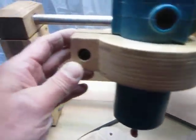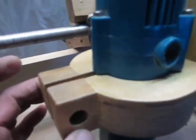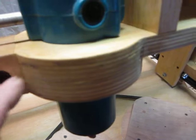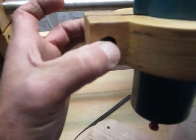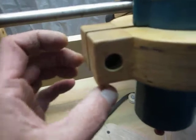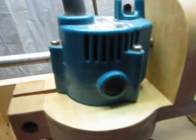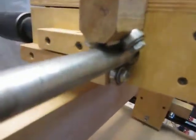For the upper part I used birch plywood. I glued two blocks — I didn't like the idea of drilling a hole in the face of the plywood — so I glued two pieces of maple and used the same bolt that holds the wheel in a roller skate. I countersunk both holes, and it takes an Allen key to fasten the laminate trimmer inside.